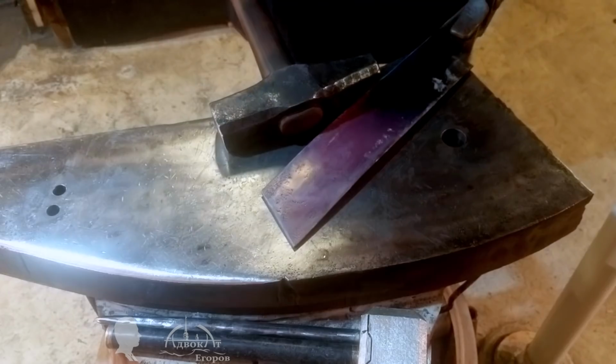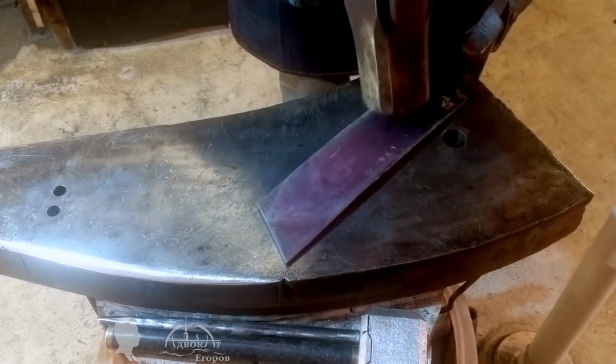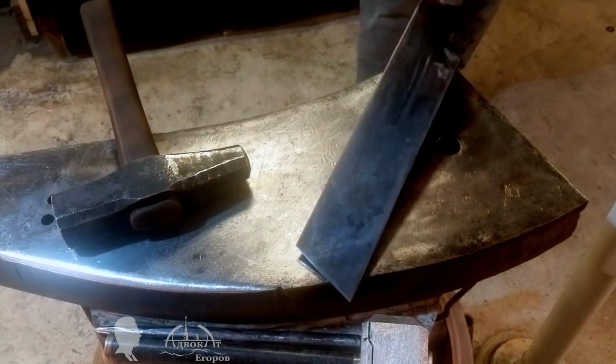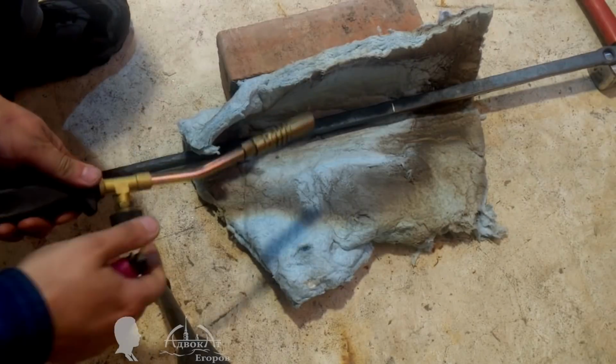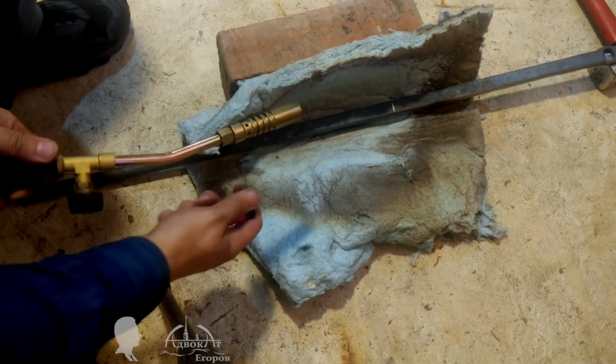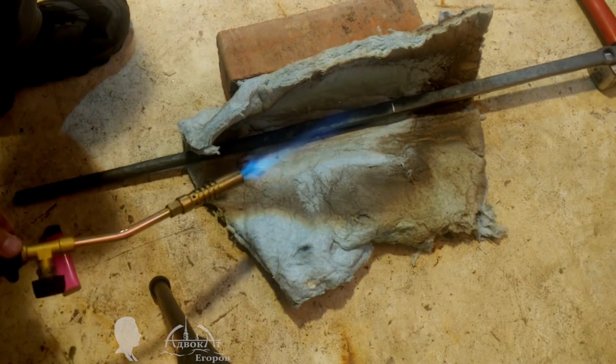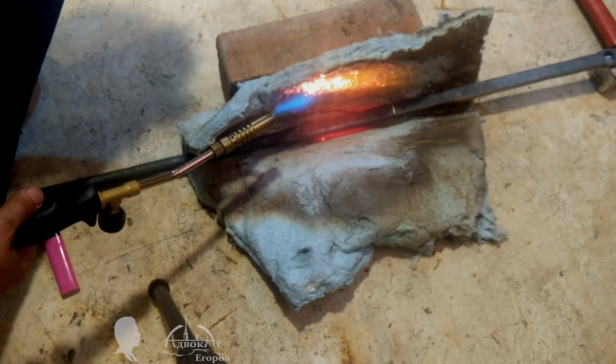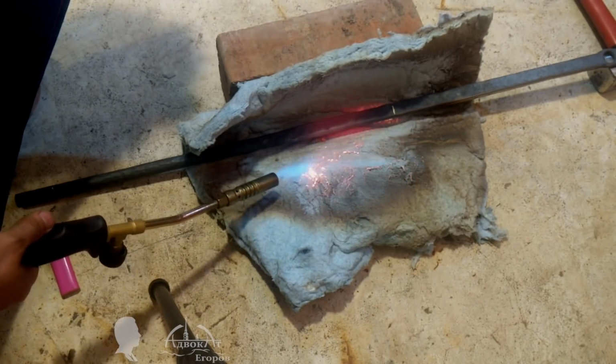Ergonomically, the point of force application, which is going to be the grip portion of the tool's handle, should be on the line of the blade's cutting edge and the knife's mounting point. Otherwise, it will be twisting out of your hand during use. To properly align the knife's parts, I slightly bent the handle in a fishtail shape.